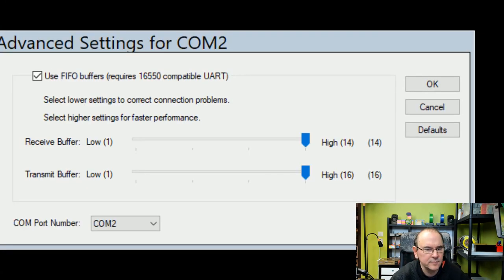Yep, there we go. So, here's the window. And then here you can change what COM port the adapter will be using. It'll give you the list, if XSplit would show the drop down, which it doesn't, you would see all your COM ports and whether they're in use or not. And then you can hopefully assign it to a COM port that's less than COM5. Otherwise, you won't be able to use the meter. So that's the physical installation of everything required to get the serial connection to work. The driver is installed, driver configured, and now we can actually go to the meter software.